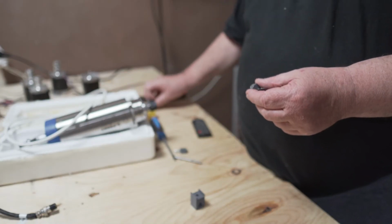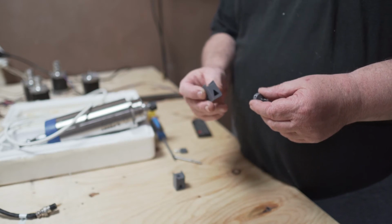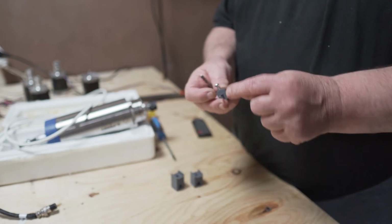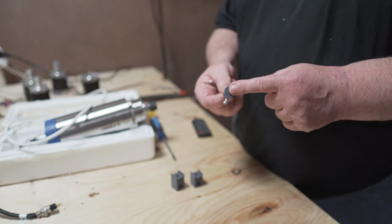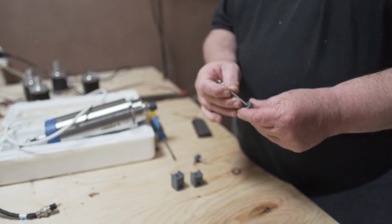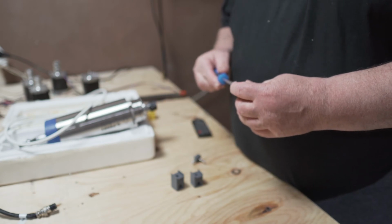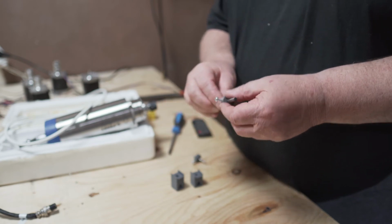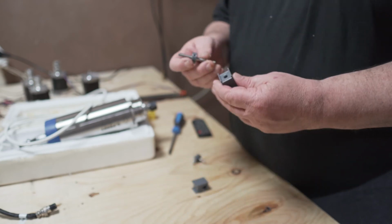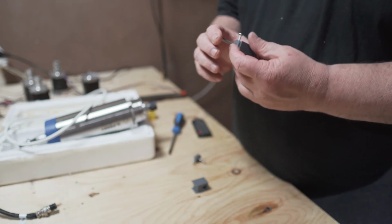I have made one more, one at 25 millimeters and one at 20 millimeters. But the whole point is to get the same length on the tools here. So when we have measured the length on the probe, it will be the same for this tool as well. As I said, there will be a 4mm set screw on both ends here. So I can now take this part here and add my tool there and secure it.